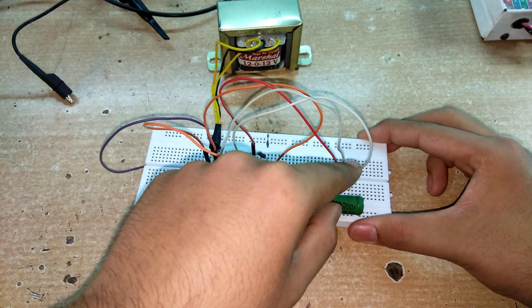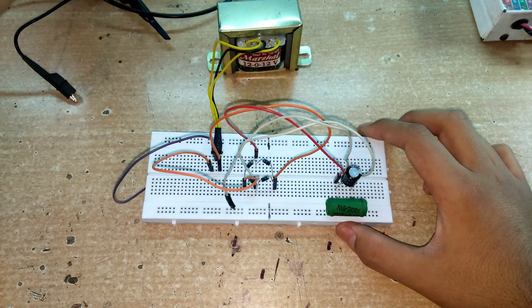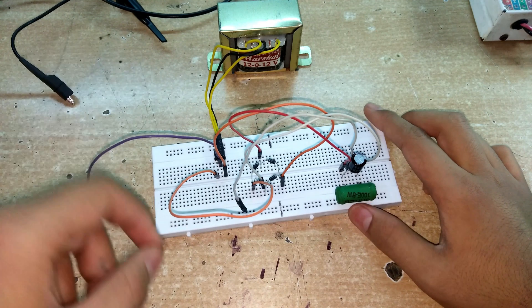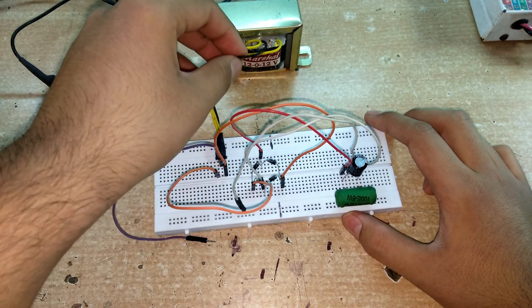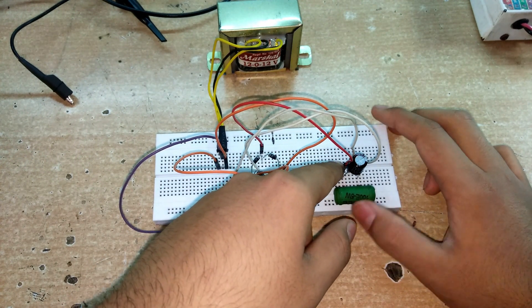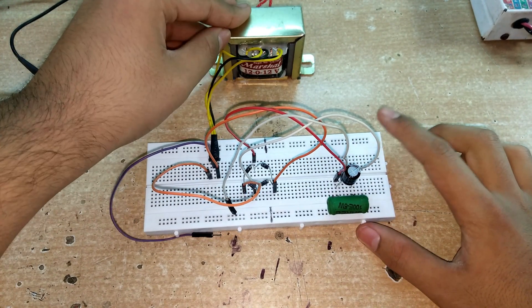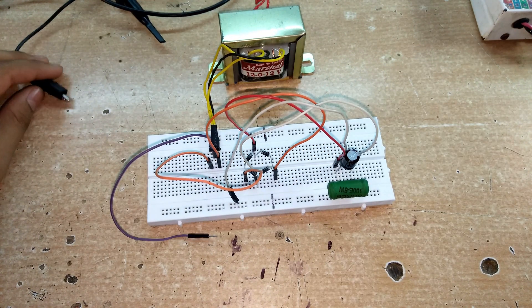I have used a high voltage 50-volt rated capacitor because my 220 microfarad capacitor is only rated at 25 volts maximum, and I don't want to risk blowing up the capacitor. The black wire is going to act as ground. If you want to draw 12 volts from this circuit, use the black wire as the reference ground at 0 volts - the white wire will be at plus 12 volts and the red wire at minus 12 volts, giving you a plus/minus 12 volt supply. This configuration is mainly used in function generators to generate positive and negative power rails.